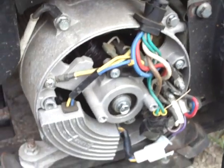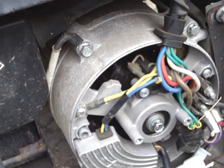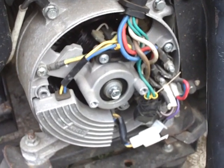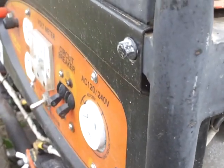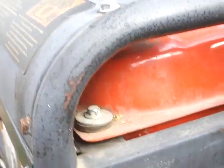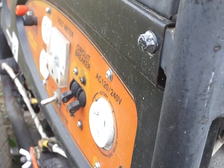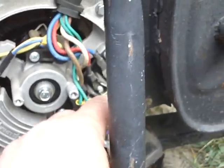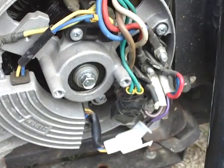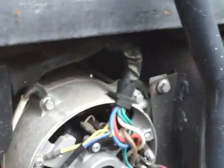This one runs 120V very well and supplies great amperage — I've got 30-amp breakers in it and it runs them perfectly. I've tested the breakers by purposely momentarily shorting the gen head, and it clicks the breaker quickly. So I know the breakers work, and that's what's important after a rewiring job — making sure your breakers are not going to upset the gen head. Because if you bake the windings in one of these generator heads, you might as well replace it since it's costly to repair.